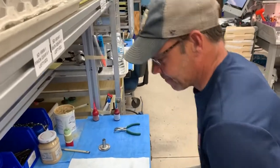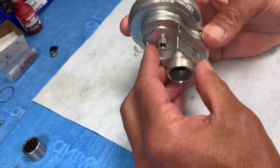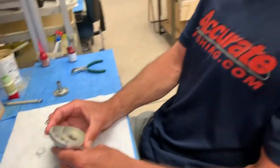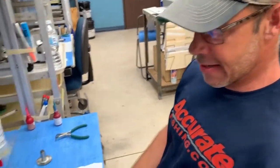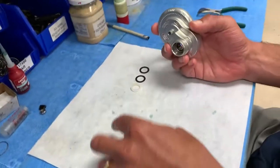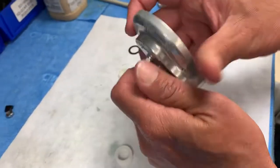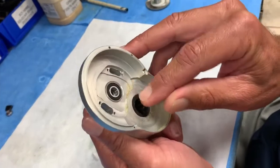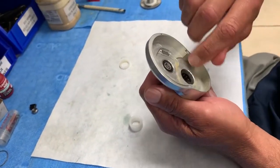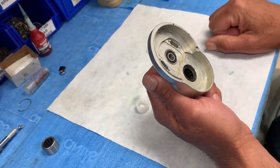Once we get the bearing pressed in there, we actually did something else besides design this bearing. We went back and revisited all the water intrusion issues that we've seen over 20 years and figured out there's got to be a better way to keep the water from getting in there. So what we ended up doing was allowing these spaces on both sides of the bearing. We take these little rubber washers and pack them way down on the bottom of this bore on one side and also on this side. These rubber washers are a little bit bigger than the outside of this hole and a little smaller than the shaft diameter. So when we push this in there, it actually makes a real seal around the side plate and the gear shaft — which is a big deal. That's what stops the water from getting in.